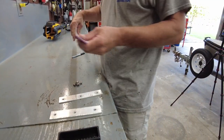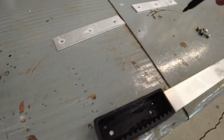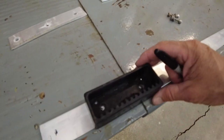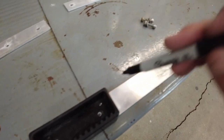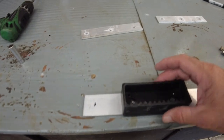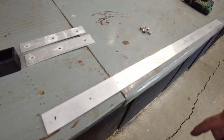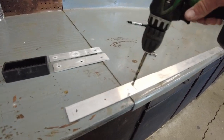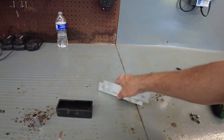Over here at the bench, basically all I did was take a piece of flat plate like this right here that I got from Lowe's. I just evened the plate up with the bottom of the mount and marked the first hole to be drilled, then marked the second hole. I slid it up, lined up the top hole, got it straight, marked the top hole again, and at the same time marked where to cut it off. That's pretty much it — that's how I came up with these mounts. Once you get these two laid out, I just took a 5/16th inch regular drill bit, used a center punch to punch the holes so the drill bit doesn't wander, drilled them out, then used a hacksaw to cut it off. You'll end up with this — that's ready to go.